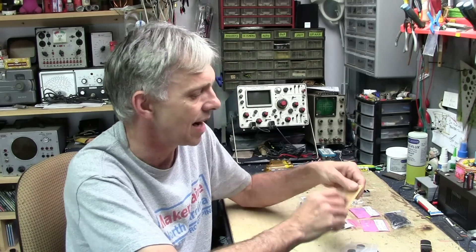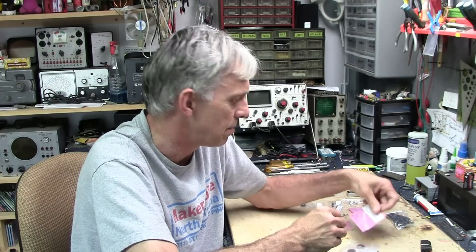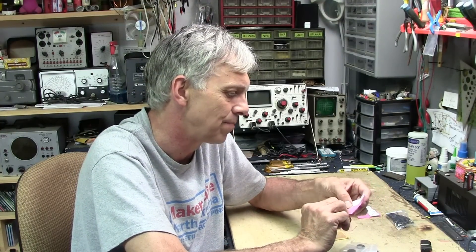I think the ZumoBot is about $100–$125. But I want to do a little mini bot here, and the mission statement on this project would be: build it really tiny, just really minimal on the batteries and very small motors. And as you saw, that motor is indeed really tiny. The neat thing about that motor is it will mount in a standard 5mm fuse holder, so you can build the whole thing on one of these perf boards. I picked up a microcontroller from Pololu — I think this was about $15. Tiny little thing.